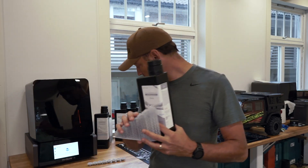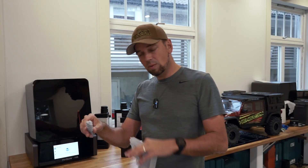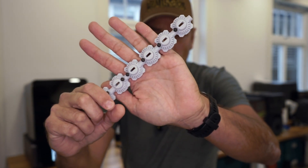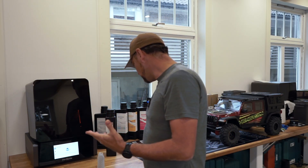This is the gray resin I used to print that light bar. You can also see that I really needed to put a ton of supports in it for a successful print, and I used kind of the entire build volume of the printer to get it done. The result is a piece that looks like it is injection molded — a really perfect, super smooth surface. With this gray ABS-like resin it also has some mechanical strength to it, so a great print overall.